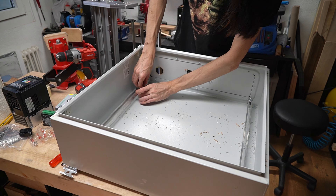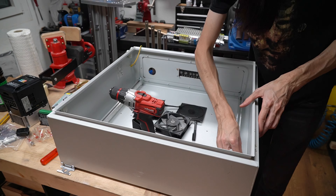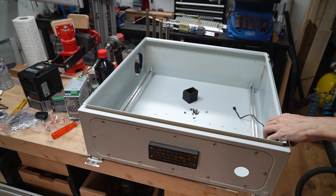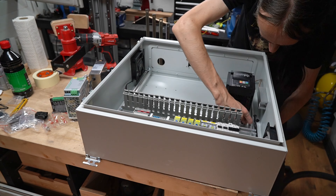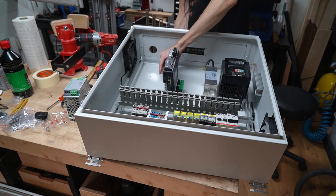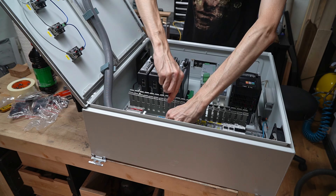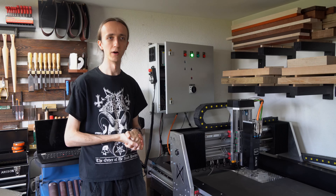After completely gutting the cabinet, I started laying out everything and making sure all the different components are spaced away from the walls as required. I added holes for fans - an intake fan on one side and an exhaust at the diagonal other corner - to ensure airflow so it doesn't heat up. I then screwed all of the servo drives into the back panel. Ideally you'd use a sub-plate you can take in and out, but the servo drives are quite tall so I had to mount them all the way at the back.